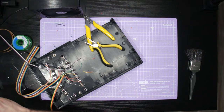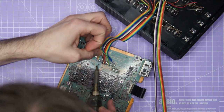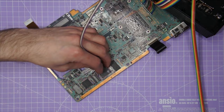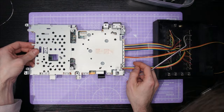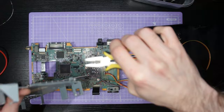Now with the wires soldered to the switches it's time to solder the other end into the main board. Once we've trimmed and tinned all of the ends of those wires, go ahead and carefully wire them in one by one to that little section of perfboard. Let's not forget the audio circuit bends we added in as well. Now this is where I realise I don't have enough clearance between the metal chassis and my ribbon cable, so I'm going to use a pair of pliers to bend a section of this metal off and provide a nice bit of clearance.